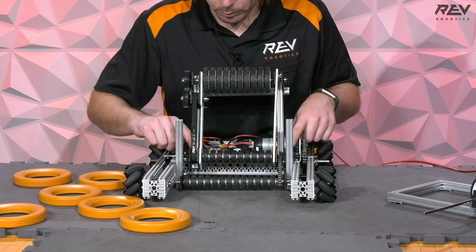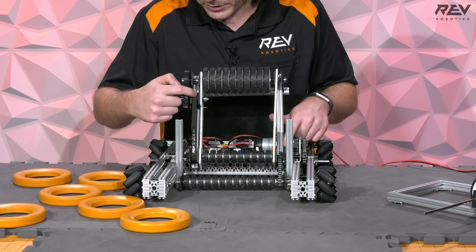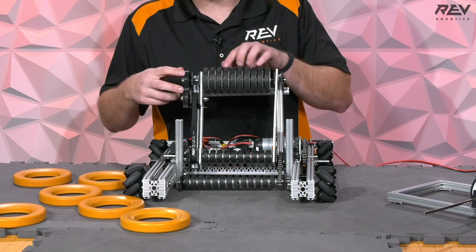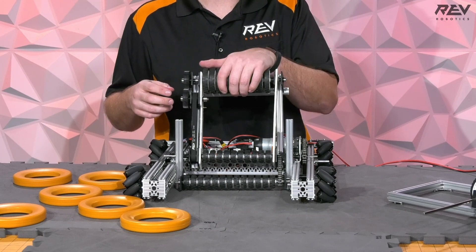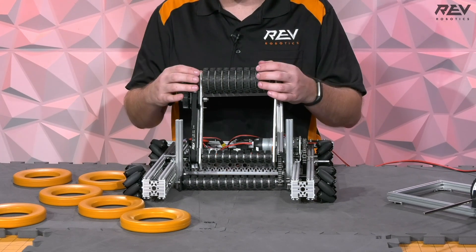This then goes over to our pulley that we have sandwiched in on this side, which runs this belt up to a gear up here that meshes with another gear. That allows us to change the direction of the front roller, because the front roller and the back rollers need to run in opposite directions to get the needed outcome.